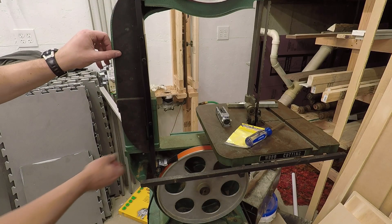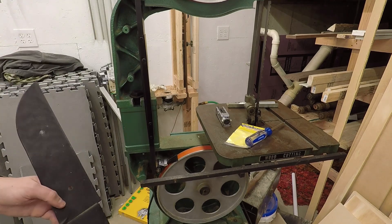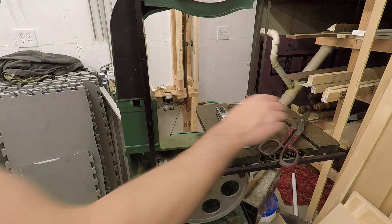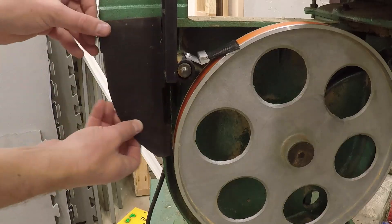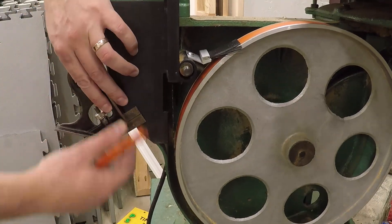The plastic filler piece on the column is no longer long enough to cover both cavities in the upper and lower castings. The easiest way to remedy this is to cut the plastic piece in half — the top section screws into the existing holes, and the bottom piece needs new holes drilled and tapped into the casting to hold it in place.